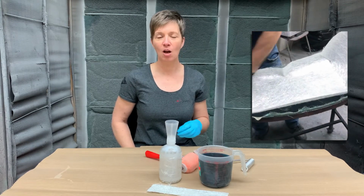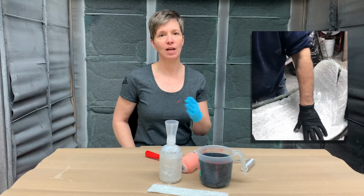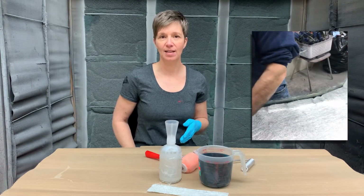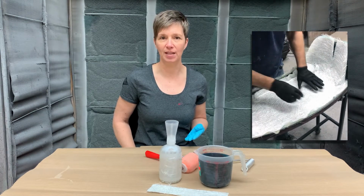If we don't put enough, we will unnecessarily lengthen the hardening time. On the other hand, if we put too much of it, we will reduce the time, which is not a good thing since it can cause cracking in our parts.